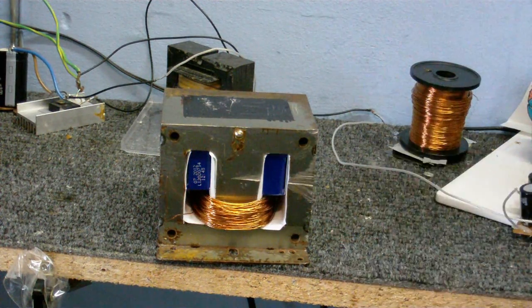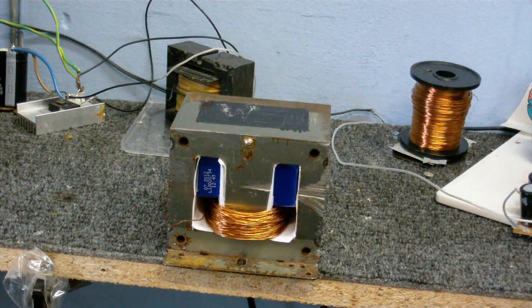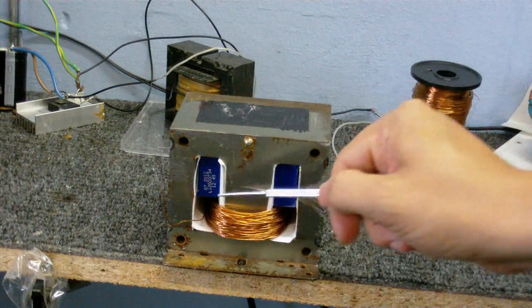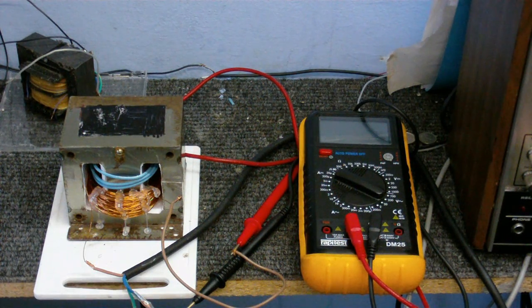As you can see, I've started winding a primary. I've stuffed a couple of Smarties boxes in there to keep the primary so it's only fitting about a third of that gap. Right now I've only got about 2.8 ohms of wire on there and that took me all evening and I've still got plenty more to do. Even though 2.8 ohms is about the same as a regular microwave oven transformer primary, I want to fill this space with windings — cram as much as I can in there so I get lots of induction. I've wound as much as I can and it's come to exactly 5 ohms. I would have liked at least 20 ohms but I think we'll have to settle for five.